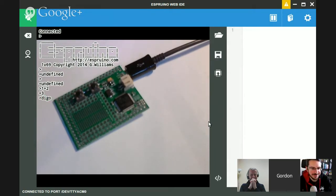And you can write Arduino-style commands. If I light the LED up, it'll happen like that. And because these characters are just sent over, you don't actually need the web IDE, you can echo them over the serial port. So on pretty much any operating system, without any software at all, you can still get it to do stuff in the real world.